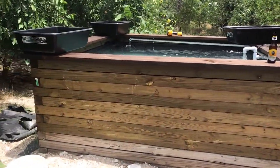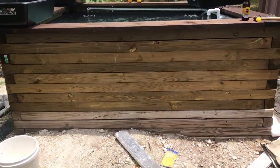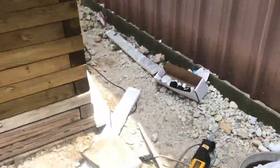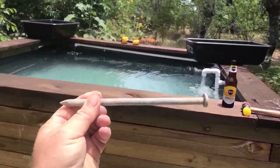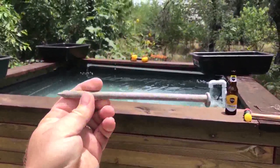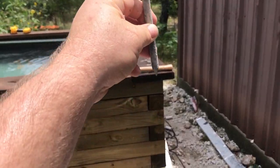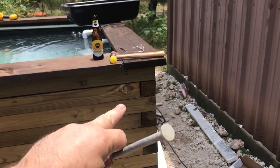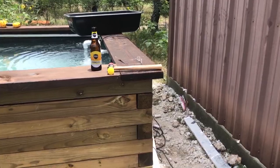What you're looking at is a tank holding about 1,325 gallons of water and it's made from 4x4 stacked log cabin style. They're held together each course — 20 nails, five to each leg and every other end, so that one goes through there, then that one goes through there, so the nails are not stacked on top of each other and cracking the ends.